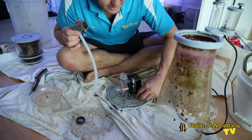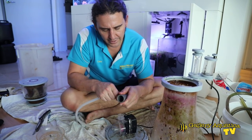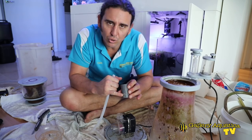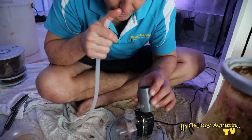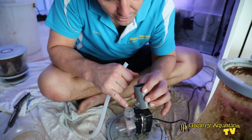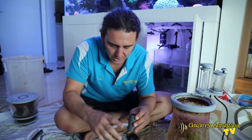Something else I'll check — it didn't seem like an air intake problem, but it's good to check the nozzle onto which your venturi tube connects, to ensure it doesn't have any build-up that could slow the flow of air into the pump. I can see quite clearly there is nothing blocking it — you can blow through it and it's definitely not blocked at all. So I know it's not an air intake issue.